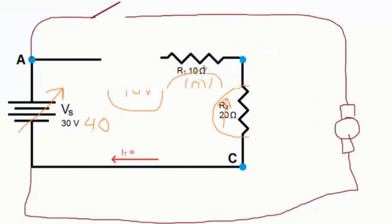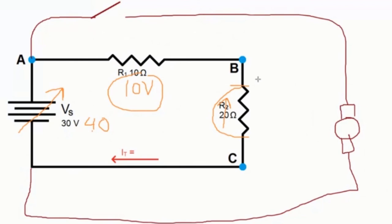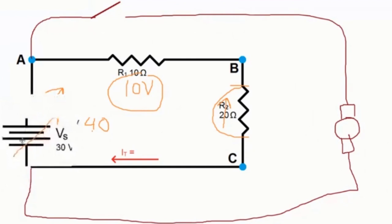So what I'm going to do is I'm going to put a pressure or a voltage compensated resistor in here. And what it's going to do is constantly study the pressure on either side. And if the pressure goes low here for whatever reason, it's actually going to make this a larger resistor, or a greater resistor, more or less, to make sure that the flow rate through here is going to be consistent all the time. And you know, if the flow rate is consistent all the time, no matter what this is, this could be 10 volts, this could be 30 volts, this could be 100 volts, this could be 62 volts, doesn't matter, whatever it is.